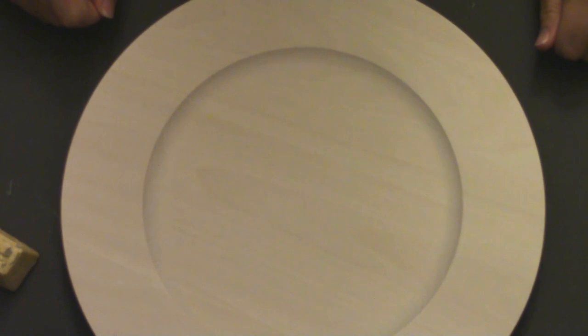So you have your tools, your knife is sharp, it's time to pick out your wood. Wood choice is very important. When selecting a piece, you need to consider both the hardness and the grain. If there's a specific look you're going for that requires a denser wood, you may have to sacrifice the intricacy of your design, because it's challenging to do intricate work on hardwoods with greater wood densities. In this instance, using a less dense wood and then staining when you're finished may be an appealing option.